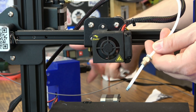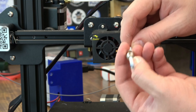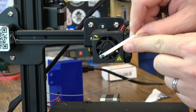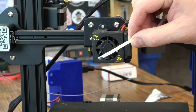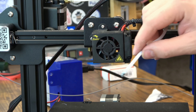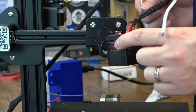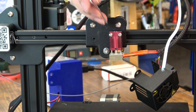I just removed the whole tube — we can let the printer cool down. Once the tube is out, it's much easier to pull the coupler off. The tube should still be usable in this state; there's not much print time on this one at all, but definitely check it. We'll take off our fan shroud — that's this screw and this screw over here — and swing it out of the way. Then there are only two screws to hold the hotend on. We'll back those out and our hotend is loose.